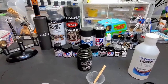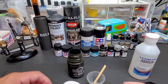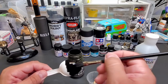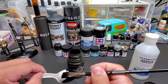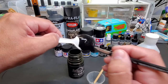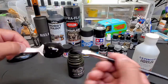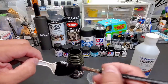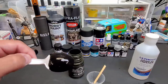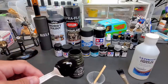While we've got it open, let's go ahead and brush some on. We're going to go straight in without thinning it at all, just brush this stuff right onto the spoon. Now you're going to see all lumpy bumps, brush marks, and little bubbles — there's a little spot there — but this stuff dries so well it levels itself right out. It looks like it's going to dry awful with the pin bubbles, but as it dries it stretches itself out and all the bubbles will disappear.